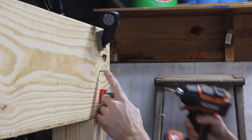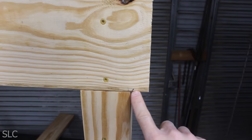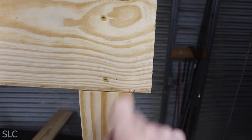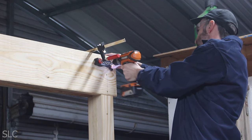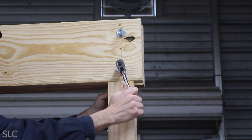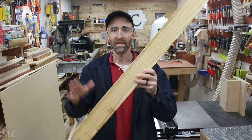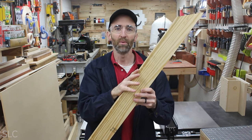To hold this board in place, I'm going to add just a couple of temporary screws. I left about an inch hanging off the end of these boards — one, I had the extra room, and two, when I add the bolts in here I figured that would give it a little more strength. Now that the main beams are in place, I cut some additional pieces that will be installed diagonal from the top beam to the legs. This will keep the legs from going side to side and give a lot more support to the actual beams.